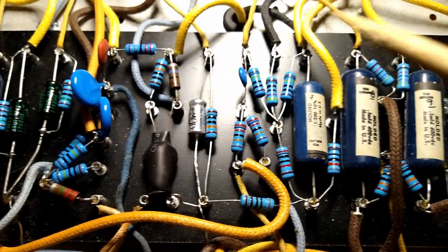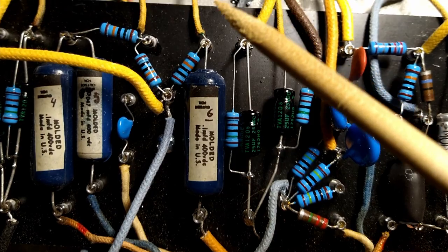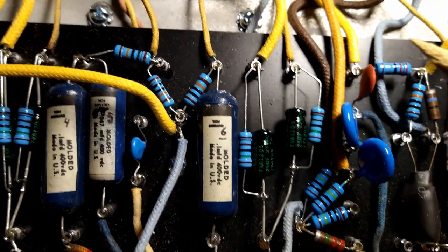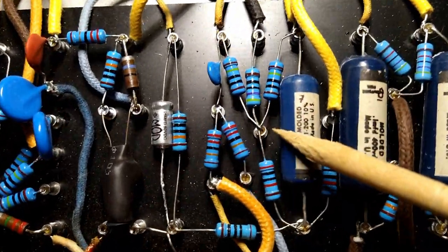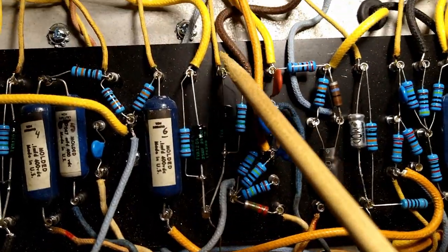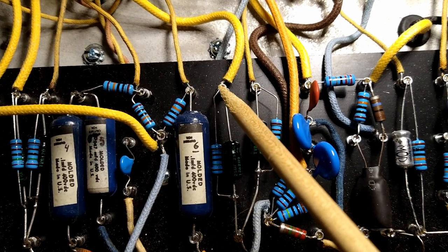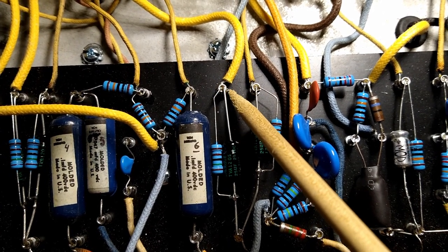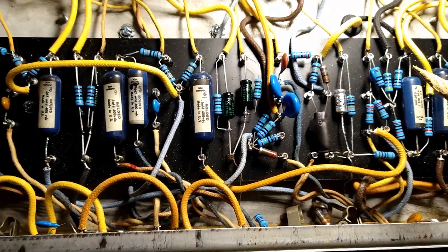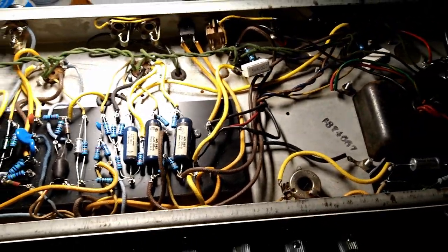And then... Oh yeah, I think I'm going to go back and just top off all the turrets. This is probably triggering some real amp techs that there's no nice little domed blob of solder on there, even though these things are not going anywhere. I originally populated the board with the components first, and then when you go back in and add the wires to all the turrets, it tends to melt the little top cap and into the inside of the turret, so whatever. We'll make it look legit. But, all right, there you go. Hang tight for that. Let's do it.